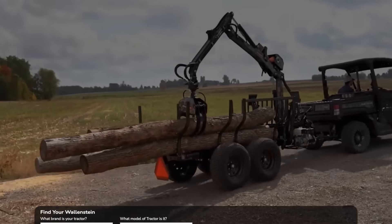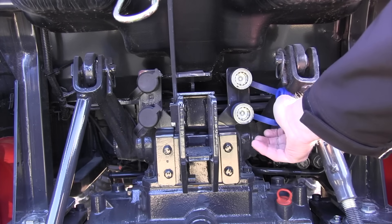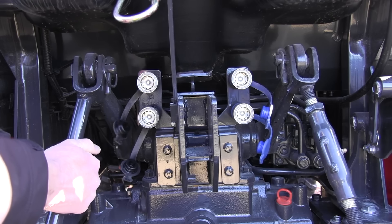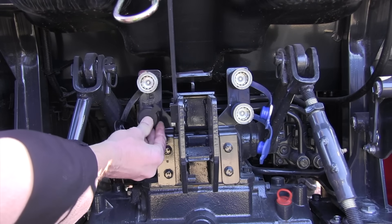If you're new to tractors, a lot of smaller tractors do not have rear remotes. This is what a rear remote is — a coupler on the back of a tractor. They come in sets of twos: flow in and flow out, controlled by a lever in the operator area. You can have one set, two sets, three sets, or up to four sets, each being two couplers — two holes to plug hydraulic hoses into. A lot of your smaller tractors do not have these.